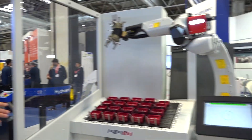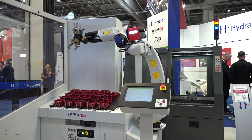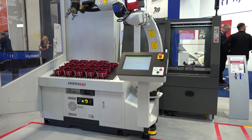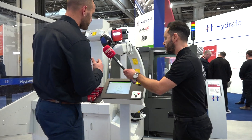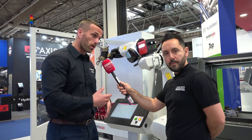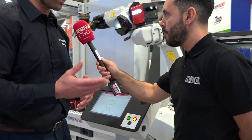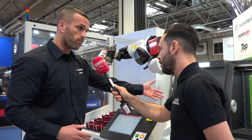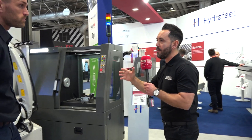Moving on to one of my favourite products — the Robo Job. Have you had much interest in this at MAC? Traditionally, people think of milling machines as only automatable with a pallet loader, but the two main ways to automate a milling machine are pallet loaders and workpiece handling. We're exhibiting workpiece handling here — you can see there's a 40–50 minute cycle time, giving a decent amount of run time. You don't have multiple fixtures for Op 1 and Op 2 — it's very straightforward with one vice, and you can set parts up in five minutes.